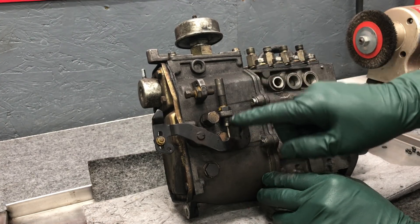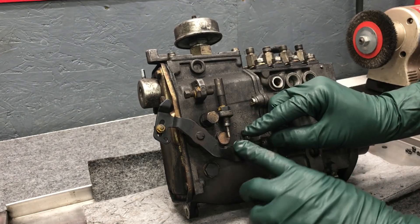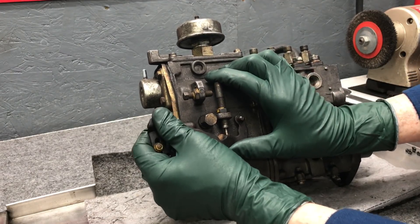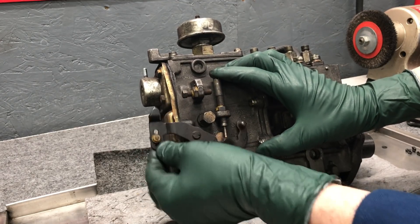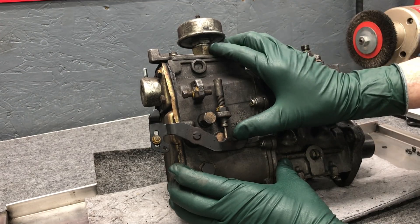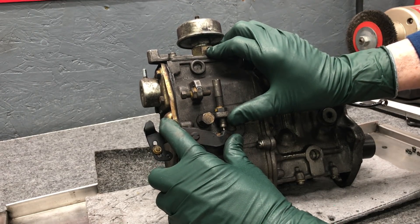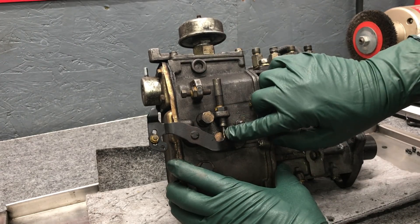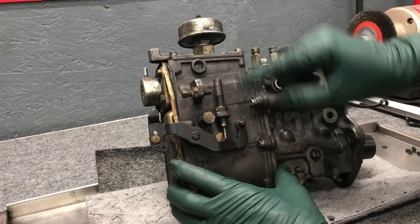There's something very interesting about the design of this adjusting shaft - this pin in here is spring-loaded. I'm pushing up on that spring. So under normal operation, this is moving up and down like this. But when you go to stop the engine with the emergency stop, you can pull up on that lever and it allows this lever to move further than normal, and when that happens it shuts off fuel inside the pump. I've seen these adjustment pins freeze due to corrosion, so when you try to pull up on that rod, it's jammed. You need to make sure this is moving freely.